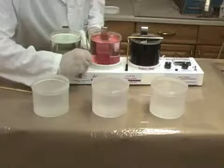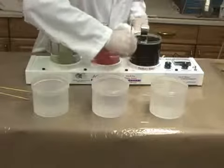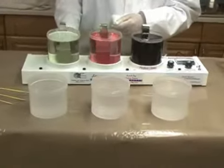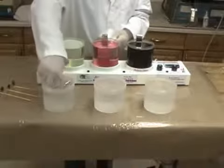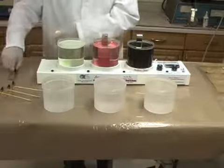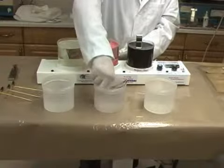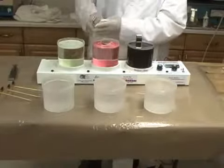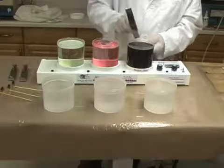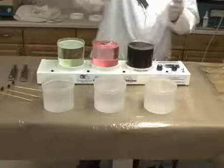When finished with the plating project, it's quick and easy to put the Jewel Master away. First, the heater and power switches are set to the off position. Then, the solution electrodes are removed, rinsed, and dried. The gold-plated bus bars are removed and wiped with a damp paper towel. Finally, the lids are replaced onto the solution beakers.